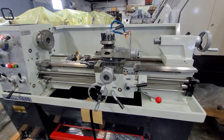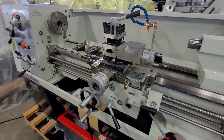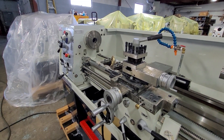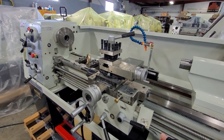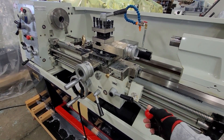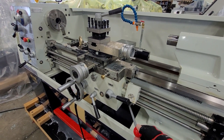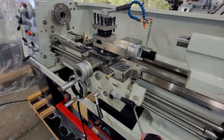The way that Willis sets up their lathe for operation, when you use the apron hand wheel, down is forward. We do understand there are some shops that like up to be forward. We can change the wiring on this to make that the way it runs for you. Please contact us if you need to have it running that way, because we set up the lathes for down being forward.